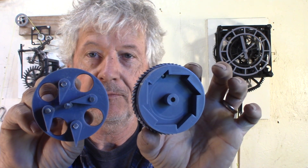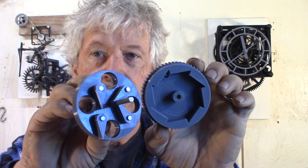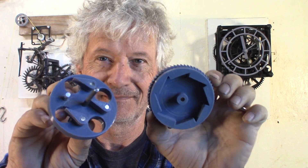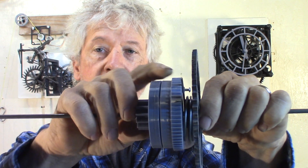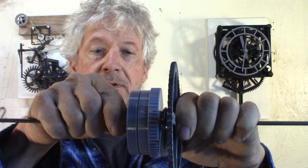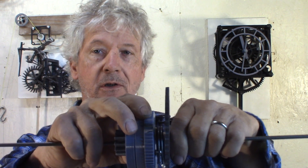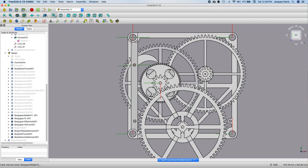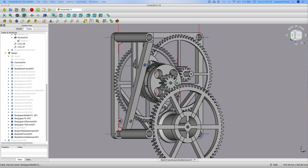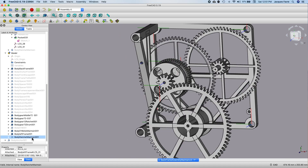This is how it works. Those are just gravity-fed. For ratchets, there's always one that will be in a good position to hook up into this part. So there's that maintaining power disc. Then there's a spring — the spring maintains the power. So there will be a ratchet that holds this, and then the spring keeps the clock going for a few minutes. Here's a view of how the maintaining power is coming inside the clock. I also had to redesign the side frame to fit the ratchet that holds the maintaining power disc, like this ratchet here.